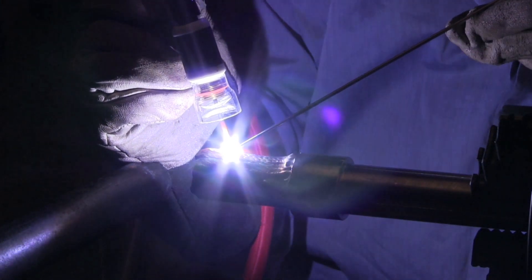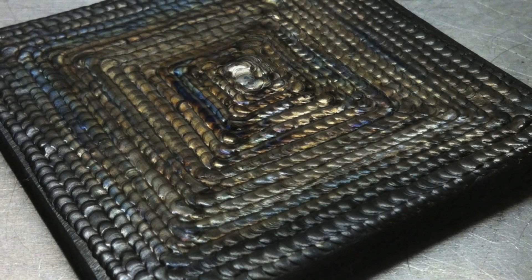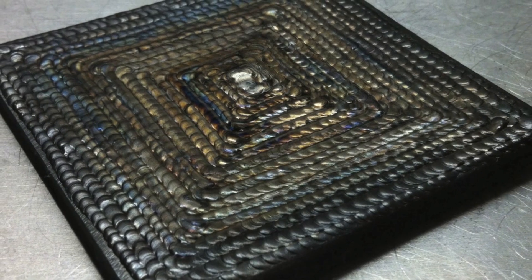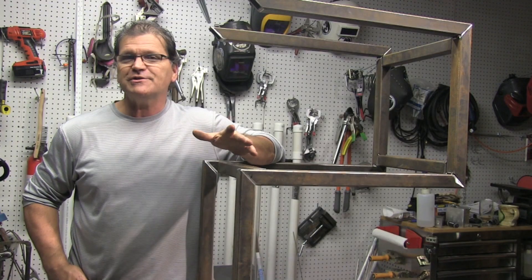There's just not much difference in running a bead halfway over the previous bead on a shaft versus doing it on a flat piece of plate — hardly any difference at all. It's some of the best practice you can get, so if you're in welding school doing this, don't think it's boring or monotonous — get the most out of it. This is a pad of beads that my friend Roy Crumrine welded; we're working on some training videos together. And because this was a video about TIG welding stainless steel, there is something called carbide precipitation — if you'd like, stay tuned for my explanation on what that is.